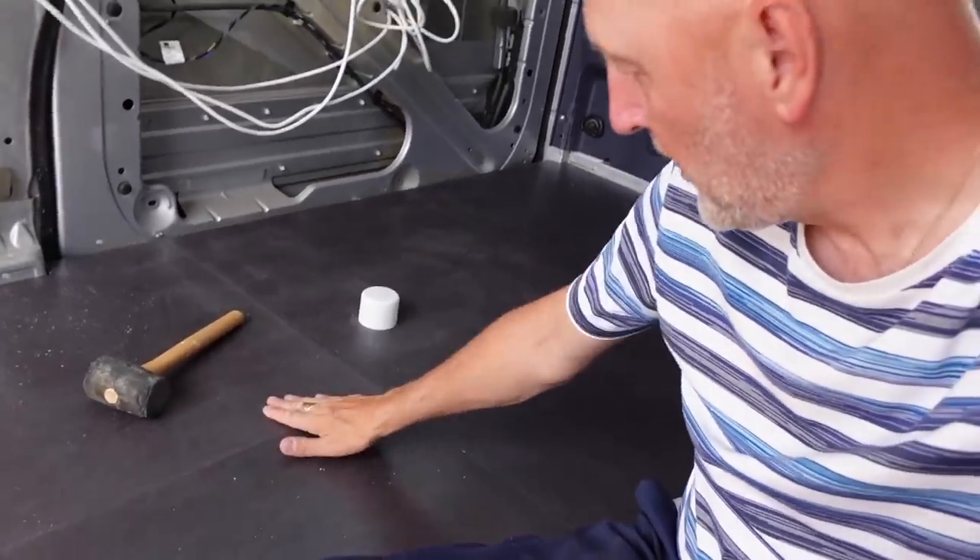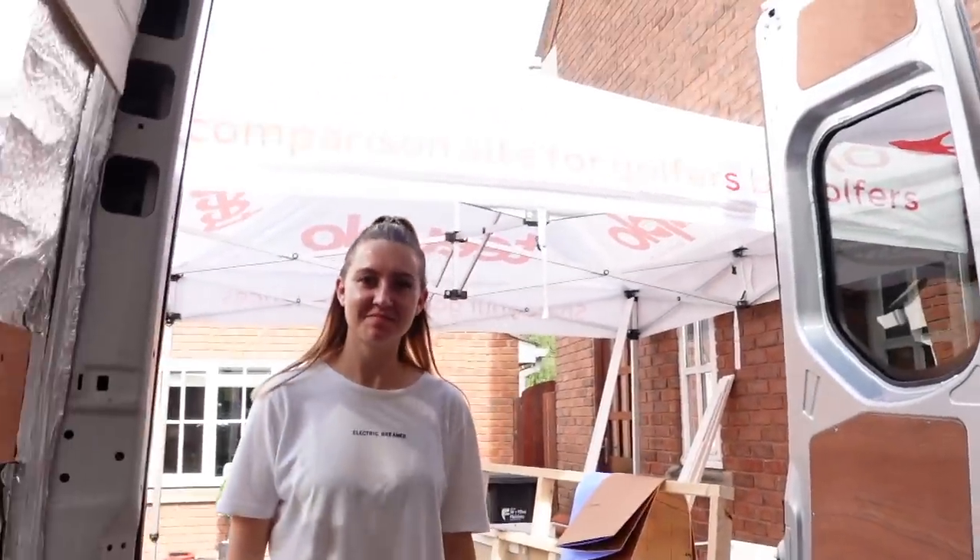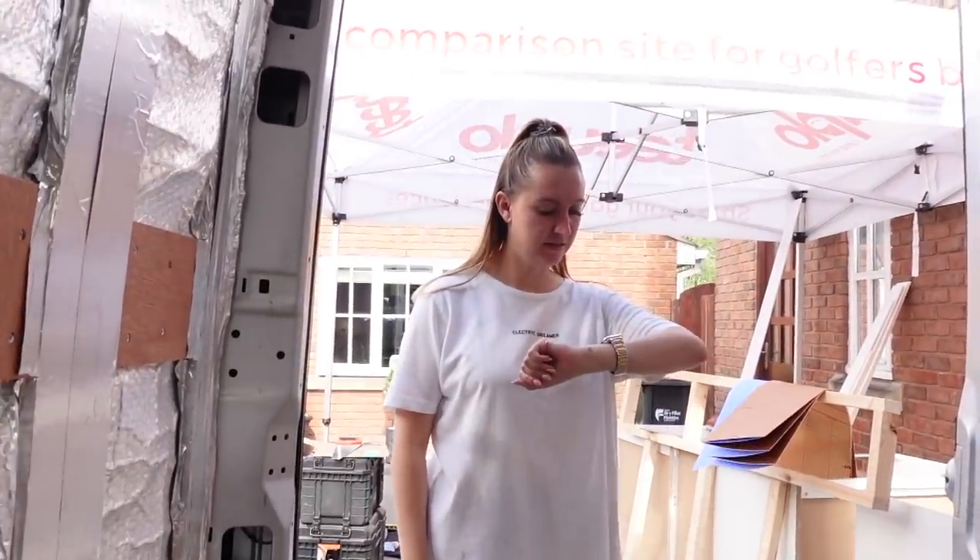Update on the floor: it's going really well. This stuff — Final Click Tile or something — is really good. You just have to make sure the grooves are in the right direction; sounds obvious, but if you get that wrong the whole thing is thrown off. You literally sit them in the grooves, hit them with a rubber mallet, and it just clicks into place — a really solid join, no lips whatsoever. Really pleased with how it's going down. Double thumbs up! It's Friday afternoon, quarter past four — going to be a late one.